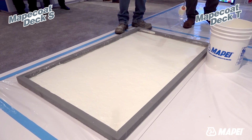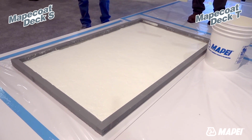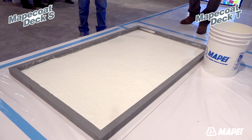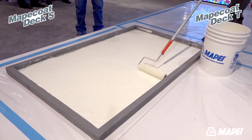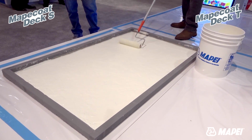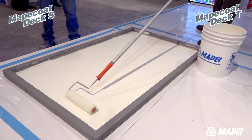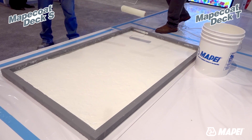May I? One of the things I learned when I was doing epoxy coatings was there's a right way and a wrong way to roll with the roller, for those who don't know. This is called the hard side of a roller. I always want to roll towards that side because this side will feather and I won't get the lines or W's on the floor. If I flip that around and roll the other way, I wind up with these lines that come across, and then you wind up having to coat it a second time. Just rolling the right way and feathering it out as you go along, you wind up with a better looking job in the end.